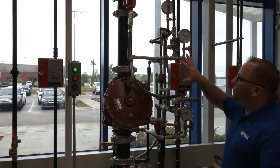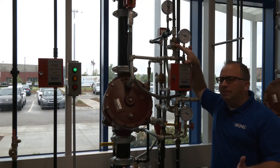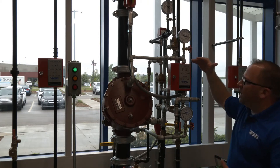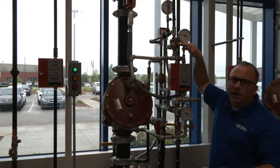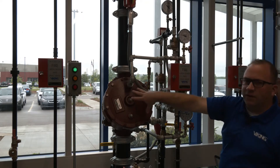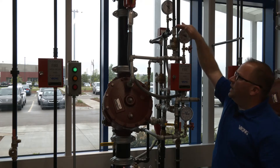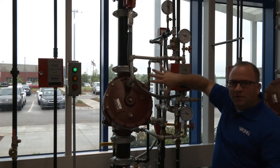This particular setup is a pneumatic release, or a dry pilot, and the trim piping that's located right here - you'll see that this pneumatic actuator is the transition between prime water pressure that holds the valve closed, and our pneumatic air pressure that is maintaining the prime water pressure into the valve itself.